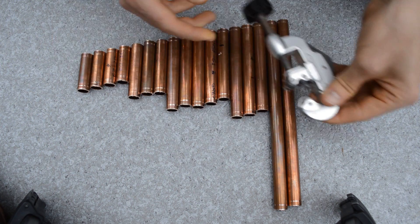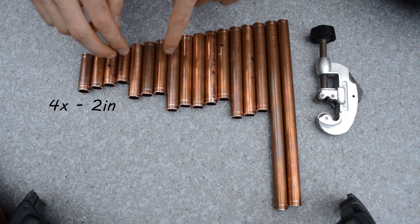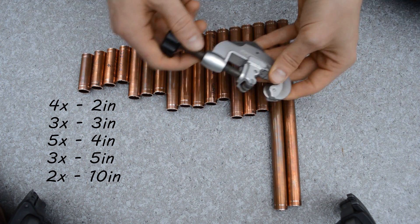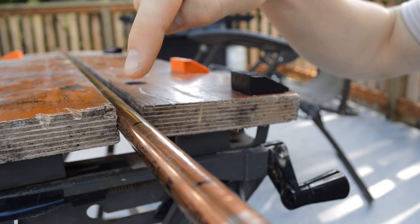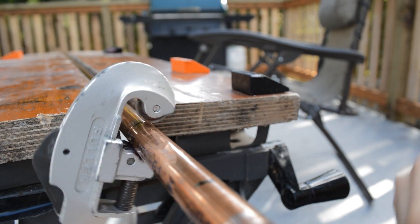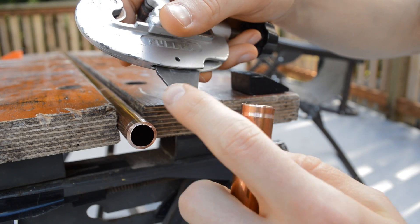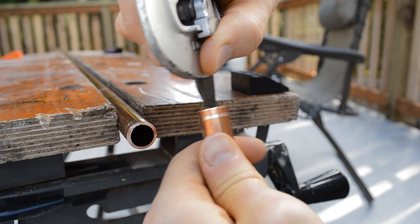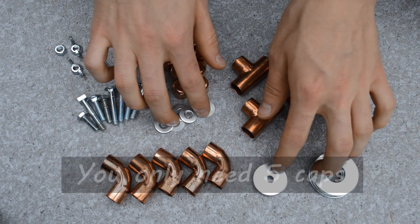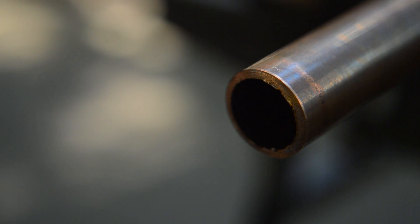Using this pipe cutter I've chopped out all my pieces of copper tubing - the exact same three-quarter inch copper tube I used for my previous stabilizer. I've got four two-inch pieces, three three-inch pieces, five four-inch pieces, three five-inch pieces, and two ten-inch pieces. To use the pipe cutter, mark where you want to cut, clamp it on the mark, rotate it around, and tighten the handle every couple of revolutions until the blade cuts through. As for hardware, I'm using five elbow joints, six T joints, eight end caps, and an assortment of washers, coarse thread quarter-inch screws, nuts, and wing nuts.